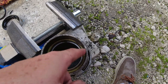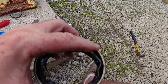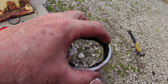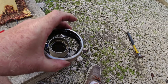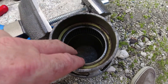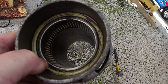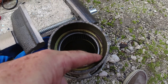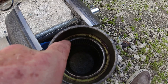We finally took off the old seal — that's it right there. This is the outside part and this is the inside part. This lip here on the inside we're going to reuse to put on top of the new seal so we can hit this old seal's lip rather than hitting the new seal and damaging it. Before you do all that, you have to clean out the whole bearing carrier from debris, pieces of shell, whatever is in there — keep it nice and clean. Then you're ready to install the new seal. The seal sits right on this side here, and you can see that little lip sticking out all the way around — the new seal has to seat on that lip, flush at this end.